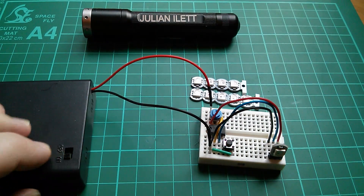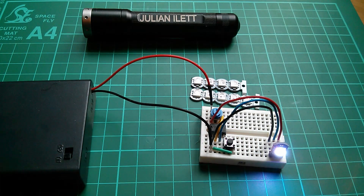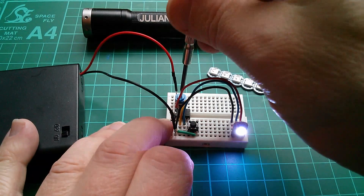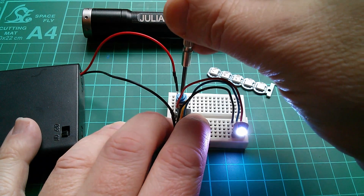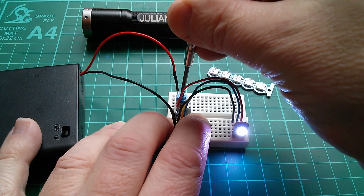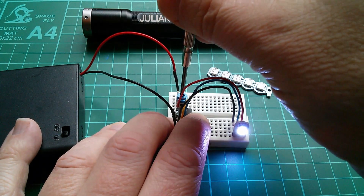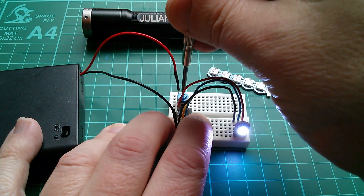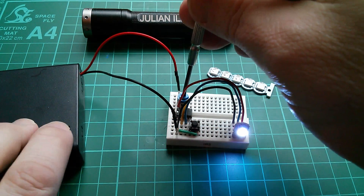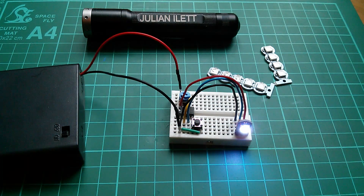Let's switch on the power. The pot's in its mid position, so it should be sending virtually a square wave to this LED, and then we hit reset. Goodness me, it works! In fact this thing seems to have huge tolerance of different frequencies — I can turn this pot to all different positions and it pretty much works quite reliably. There are even some positions where I can get it to change colour — look at that purple, beautiful. I can get some other colours too. If I turn it off and back on again, I can set the pot pretty much where I want, press the button, and it lights up. This thing doesn't require high tolerances at all.